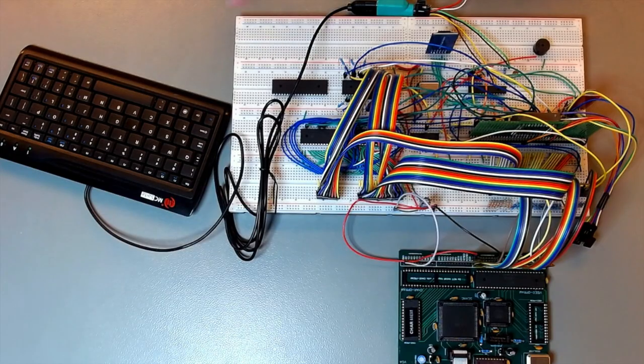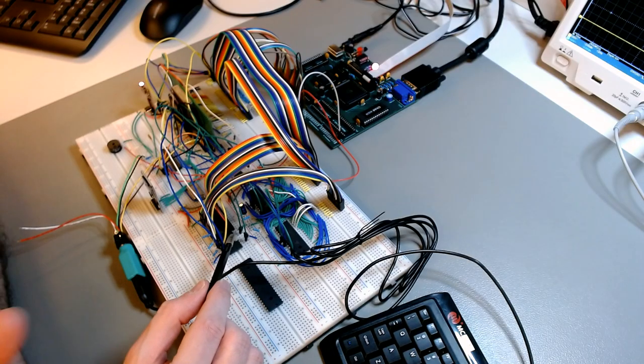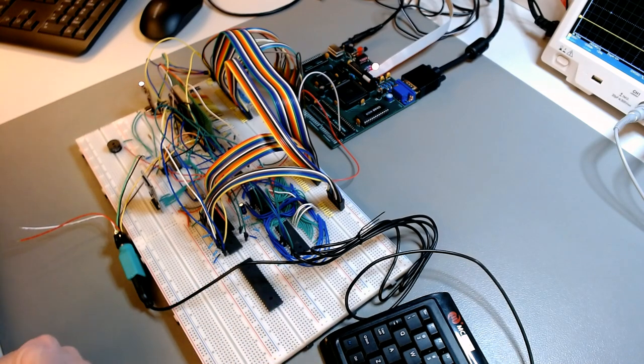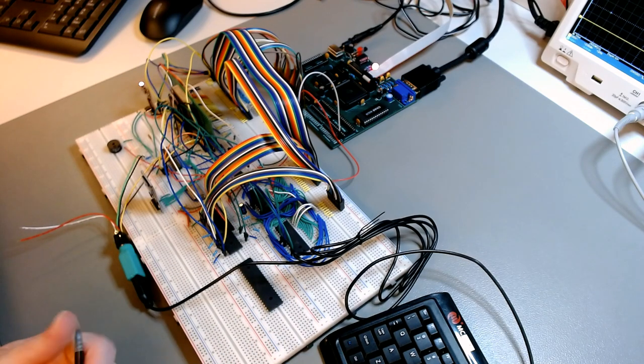I'm making use of it. I will explain all this soon, but just to give you a preview: I am using a mode when the CPU is not engaged — I not only put it in standby mode, I withdraw the clock as well. And if I restart the CPU from where I stopped it, it will continue as if it hadn't been stopped. This is very important for keyboard inputs, as I'm going to explain.